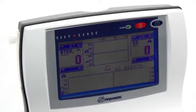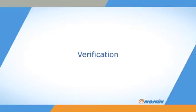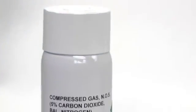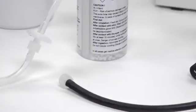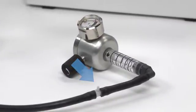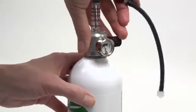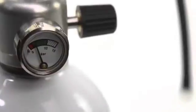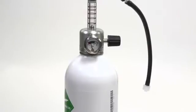Disconnect the calibration apparatus. To perform the verification procedure, attach the 5% CO2 verification gas bottle with the valve to a sample line with a T-connector on the valve. Verify that the gas valve needle is in the green zone of the dial indicator. If the gas valve needle is in the red zone, the CO2 bottle is empty and should be replaced. One CO2 bottle can be used for approximately 100 verifications.